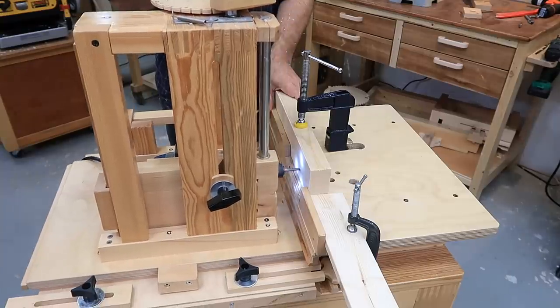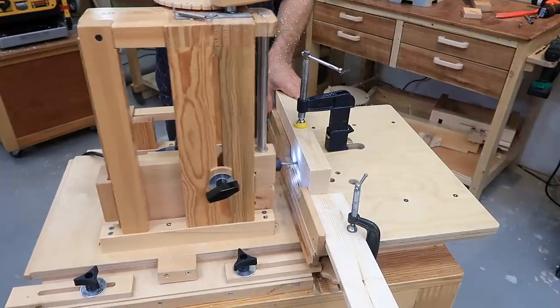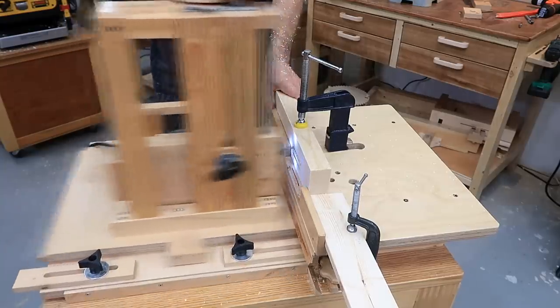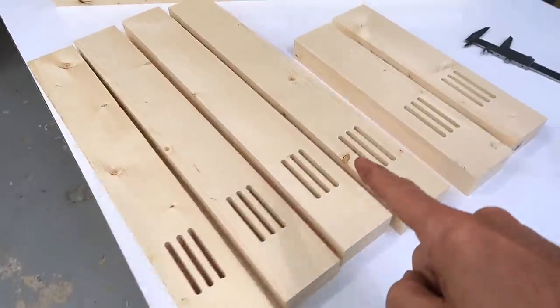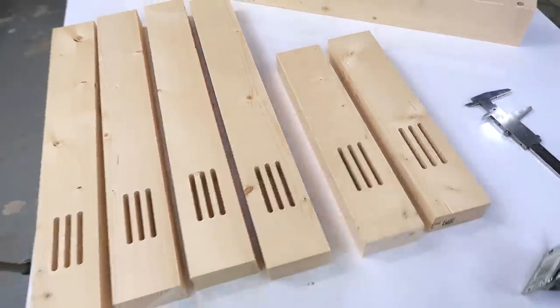The piece is just wide enough that I can put three quarter-inch tenons next to each other with a quarter inch in between, and here's cutting the mortises. Four sets of three mortises for the bottom and top pieces, plus two more pieces to tie the legs together.